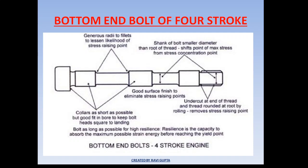In some engines the bottom-end bolt is changed after 16,000 to 20,000 running hours. If the running interval has not been completed but we still need to overhaul the conrod for any maintenance purpose, we should handle the bottom-end bolt with utmost carefulness. We measure the elongation of the bottom-end bolt after a specific running period, and if it has exceeded its limit we change it.